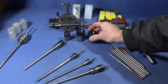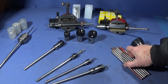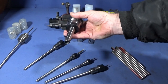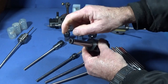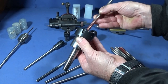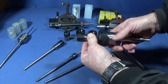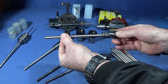I did the same with all of these — they were all a little tight and they did vary a bit, as you saw with that last one being slightly tighter than the first one drilled. I did the same with the ER32 collet chuck — just put it up in the jaws and drilled through, and the 8mm drill followed the hole that was already in there, so the bar goes right the way through. I can use the ER collet chucks with the bar on the back in the tailstock.